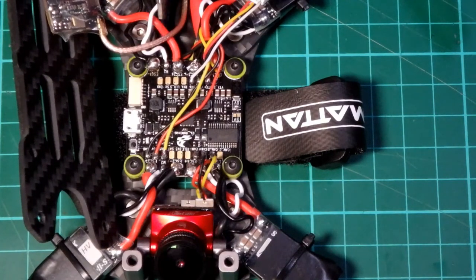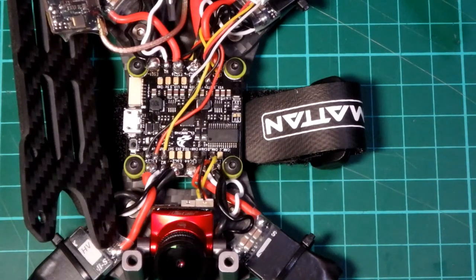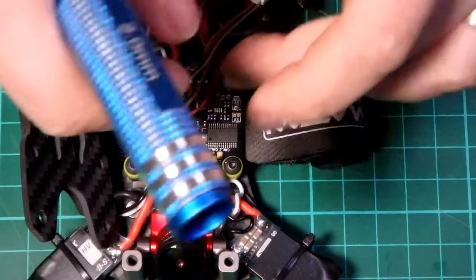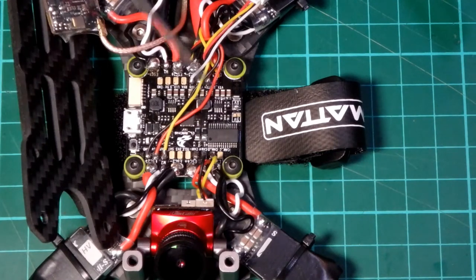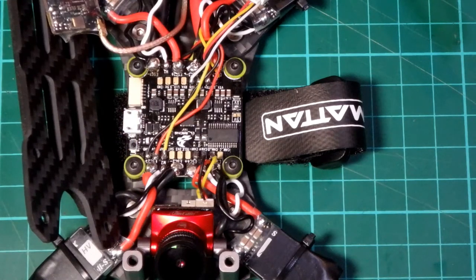The only real difficulty was soldering onto this particular pad. Underneath that pad is where the XT60 negative — or ground — is located, which meant it took an awful lot of heat to solder to. The XT60 was acting as a massive heat sink, really absorbing that heat away. On other boards the pads are normally off to the side so they're not trying to do two things at once. Overall I was really impressed with the board — it was easy to install, and that was the only thing I had a problem with, and I don't think it's a massive issue, just something to be aware of.